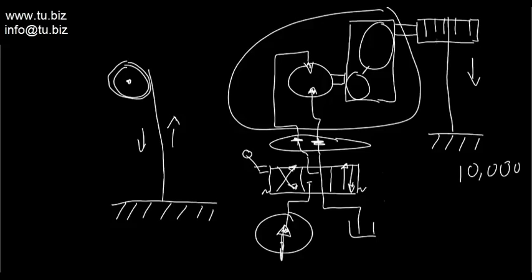The circuit can change — it depends on the loads, what kind of circuit you want for flow control, whether the locking mechanism is integrated in the motor, what gearboxes and pumps you have available. You can make this in very different ways, but the very basics of the application will pretty much look like this: often you require a hydraulic valve, a hydraulic motor with a locking mechanism, a directional control valve, a pump, and a way to vary the flow from that pump.